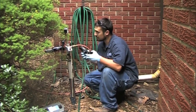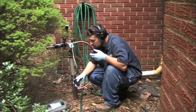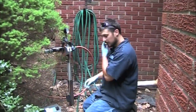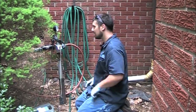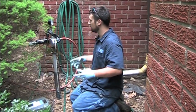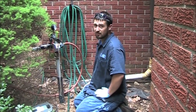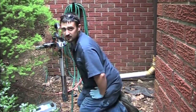Draw it up a little bit and take a listen just to make sure there's nothing going on. We've got the tank under vacuum now. I'm not hearing any noises inside the tank, aside from just some settlement. As we draw vacuum on the tank, it does shrink a little bit. It seems good — now we've just got to give it about a half an hour. As long as it stays like this, this tank should pass.